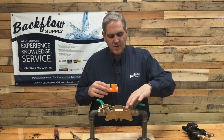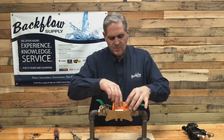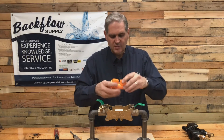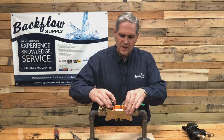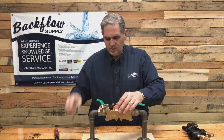Inside of this assembly, there's a little lip on the outlet ball valve and on this sleeve where the bottom of the fitting will nestle on both sides. So you'll stick it in and nestle it up to the outlet side. Normally there are o-rings on both sides of this — I didn't put those on for this video. You'll nestle that up, then take your wedge and use it to slide your sleeve up to the blowout fitting.